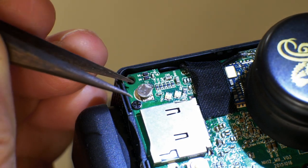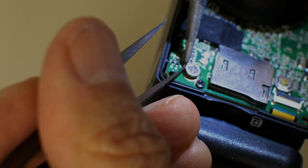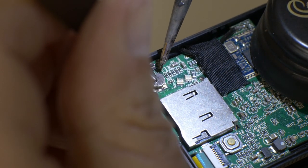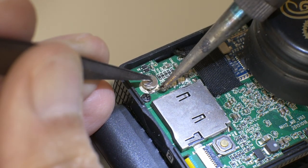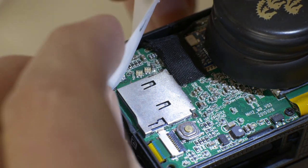The problem component is this thing here. What you have to do is unsolder that little thing without damaging the adjacent components. There we go — that's the component. Let's just clean up those pads. There's our little capacitor. Tiny! Very carefully place it in position and solder it on. There we go — that's one. You really want the minimum amount of solder possible because you do not want a solder bridge shorting out the capacitor. Check that I can slip a bit of paper under that gap there.